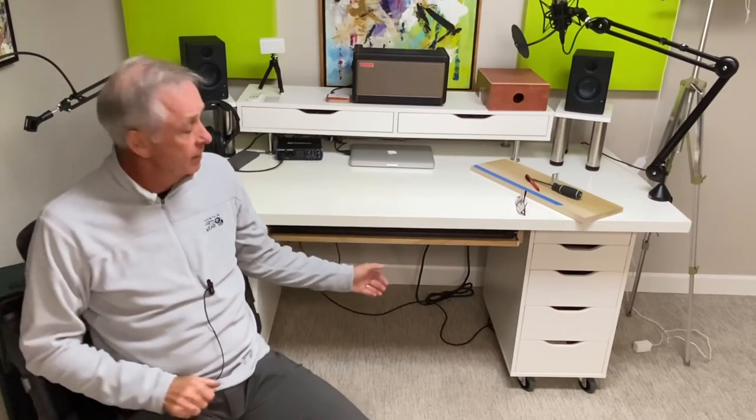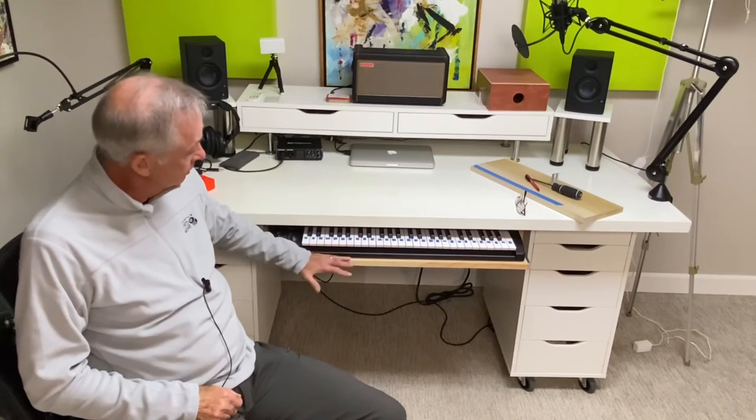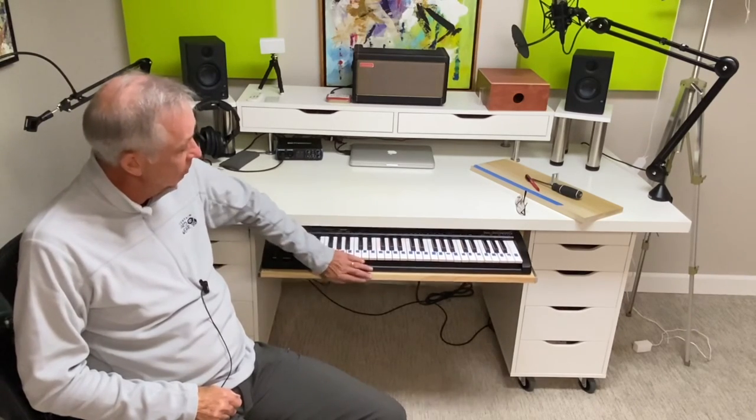That's about it — it's a pretty simple and easy project. It doesn't take too long and it works great. Just be careful to get your dimensions correct and make sure you've got enough room from the bottom of your desk to the top of the platform so whatever you want to fit on there slides under your desk easily. The hardest part is holding it up underneath to get those marks. You can do it by yourself by wedging some boards under there, but it's a whole lot easier with two people — one person holds it and the other marks. Hey, I hope this was helpful. If it was, I'd appreciate a thumbs up, and you might want to subscribe for more videos like this. Thanks for watching and I'll see you on the next video.